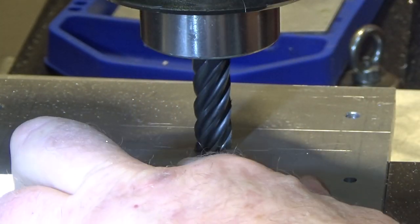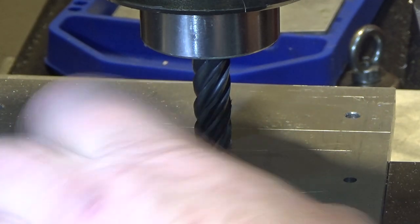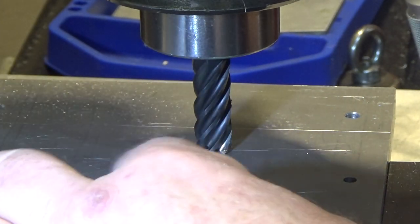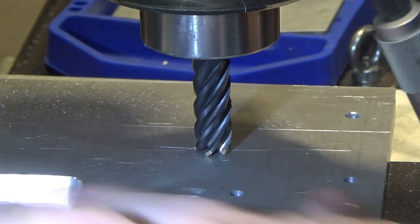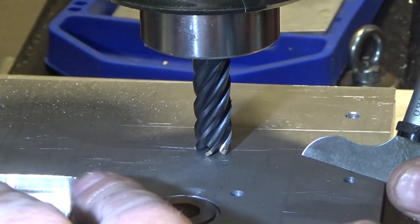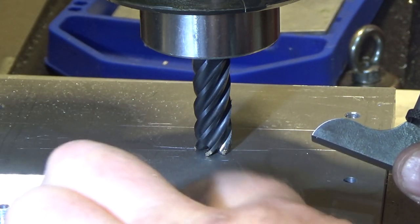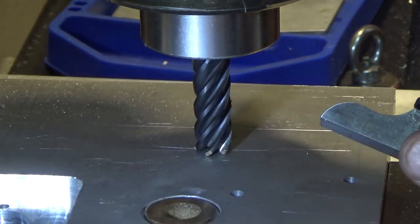Okay, so I'm about 7.5/1000ths, which will leave 15/1000ths, and my shaft is about 18/1000ths too short. That'll leave 3/1000ths slop. Hopefully that'll be enough. If there's any twist in these plates, if they're warped at all, or the screws don't have them perfectly aligned, then there'll be some extra friction because of that. So I'll check that out. I've also got to deburr this.